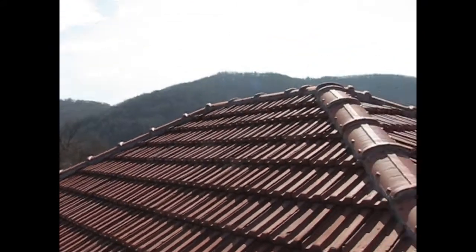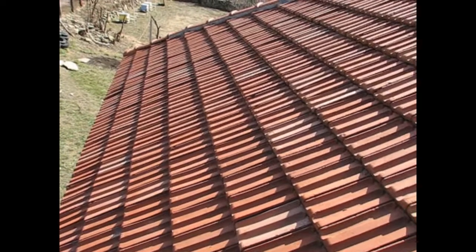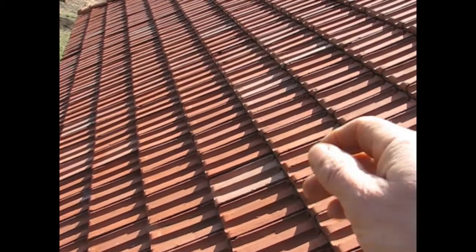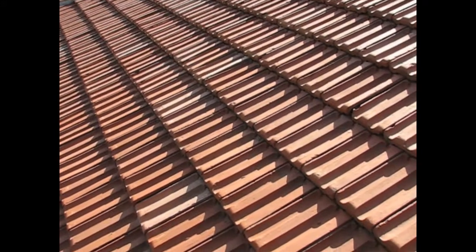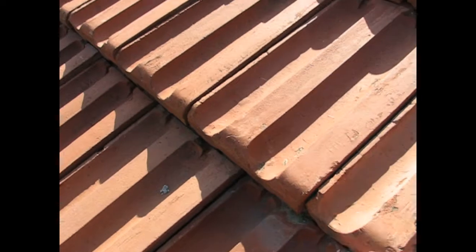Once on a roof, you start by just first looking around. You want to make sure that the roof is safe to walk on. If you see any dips, anything that doesn't look perfectly straight, that's where you don't walk — very important. So we take a look at this roof and say, okay, it's a four-hip, short-ledge roof. Look at the tiles — what is the quality? Are they flaking away? Sometimes you find tiles that are very bad quality and just flaking away, turning to nothing — I would replace all of those. These are good quality tiles; old clay tiles, very tough, fired properly. This is a good tile.